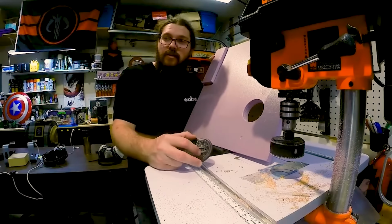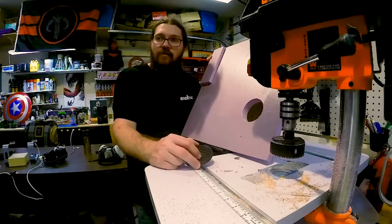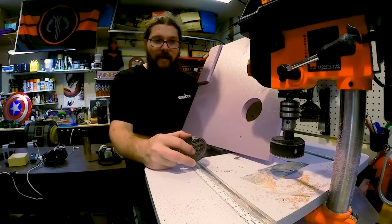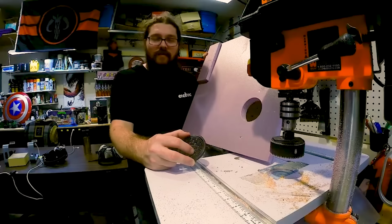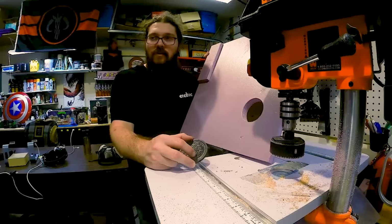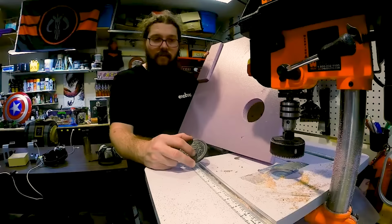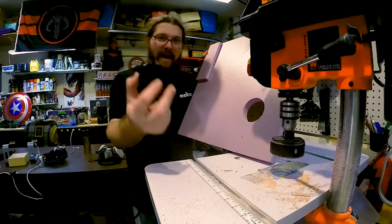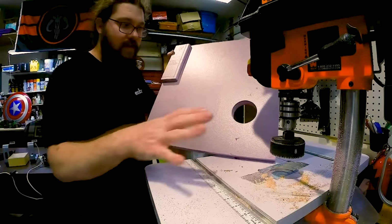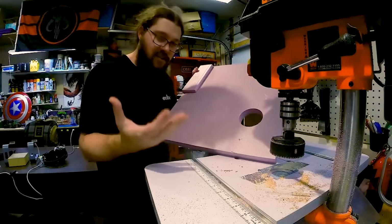After building the enclosure, I needed to do a few things to the FDM printers that I put on the bottom, just to get them some typical maintenance, especially for the Ender 3s. So I just cleaned up the nozzles, re-threaded the PLA through the Bowden tube, stuff like that. Anyway, back on printing again. I got these printed, now I'm over here cutting the holes. And I thought about it as I was cutting, hey, I should share this.